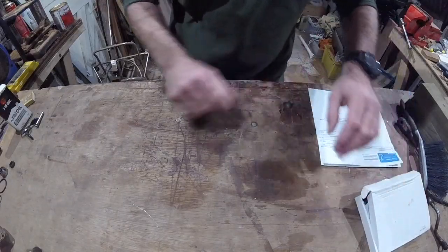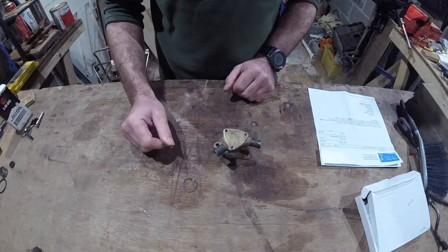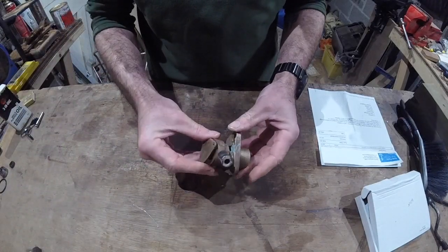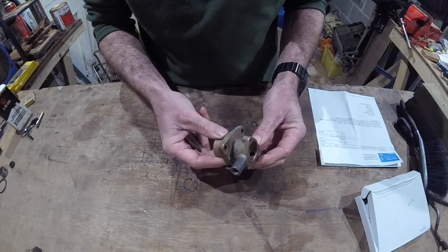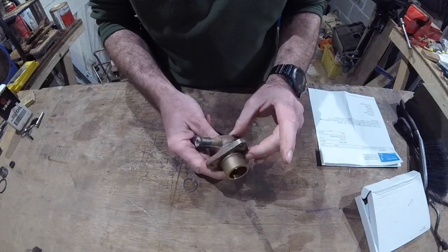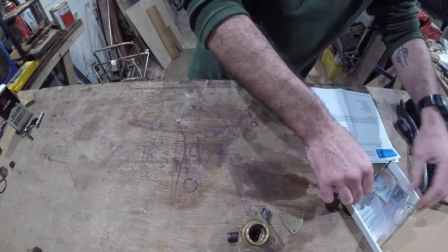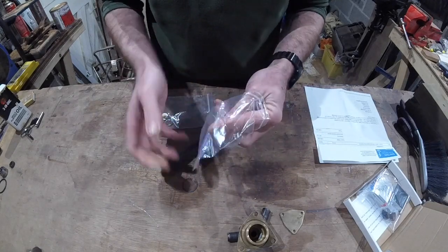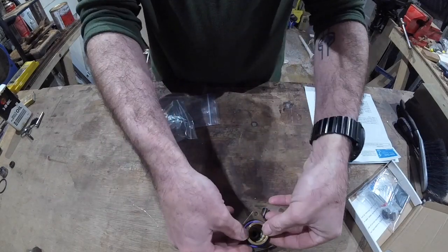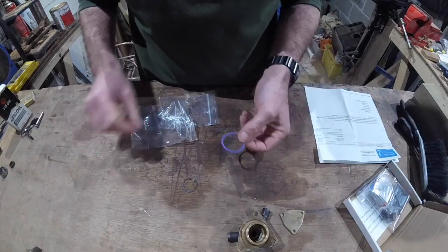In the meantime, this is the reassembly of the pump with the new parts. I'll be using the original outer circlip - that's the bearing retaining circlip. Here is the pump body that I've cleaned. I used a drain cleaner for that, basically caustic soda - a very weak solution, but I monitored it very carefully, checking every 10 minutes to see whether I could get a toothbrush on it. Most of it's come off. Nothing wrong with the pump body. This is an original equipment Yanmar O-ring, and that goes over there to seal the pump from the engine. This is the one I took out - I'm guessing that's not original equipment, but there you go. So there will be a new O-ring for that.